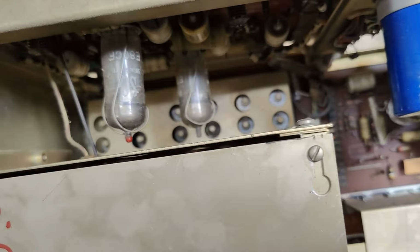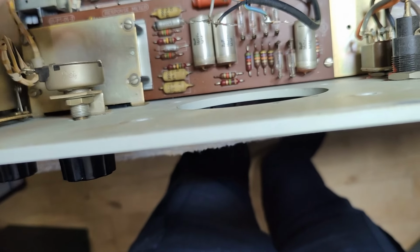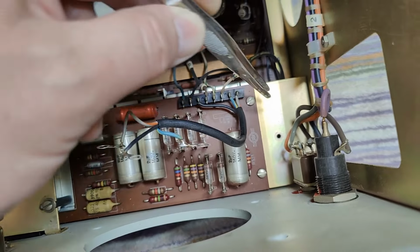And I think I figured out the black wire here. Got 3 wires to the meter, right? So that black one goes down here and it's actually connected to chassis. I just did a little ohm check. So it's just a kind of shield. And it's because we have a big open hole here with parts connected to electronics. You can imagine if you have hum, noise or stuff in your circuits, it can handle 0.3% at full range. So you have a setup here that emits all sorts of harmonics. You don't want any of this to couple to the meter and get into amplifiers and filters and detectors and create a bad readout. So I think that is why they did this. A little bit over the top, I would say, but there.